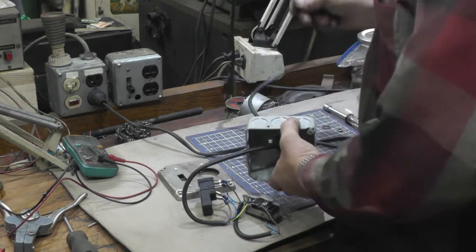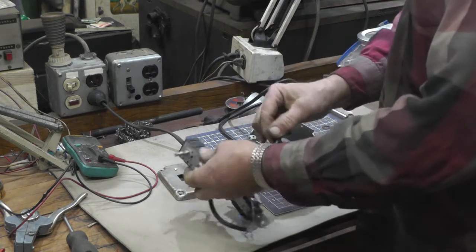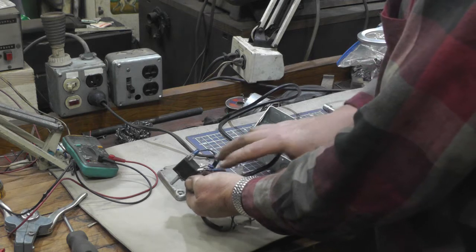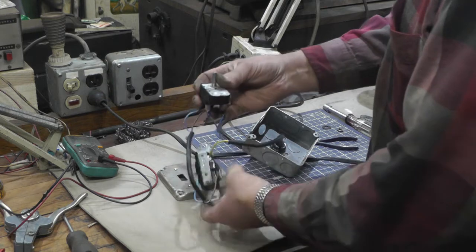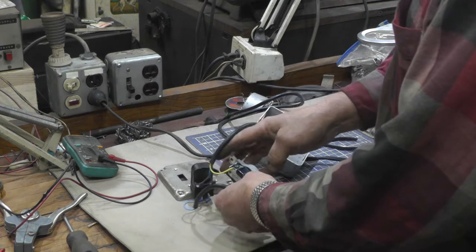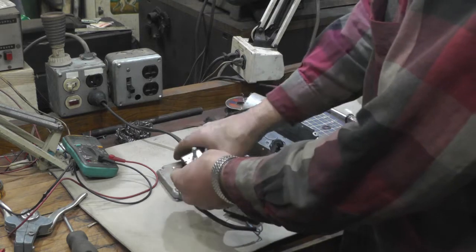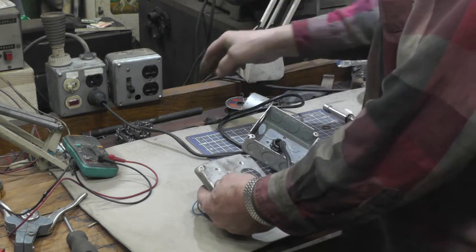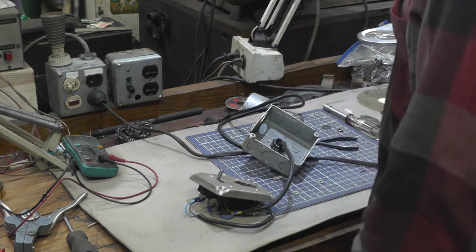The timer one is coming along. I've got the cord run through the back, same as the other one. The cord comes in and goes to a two pole switch as well, comes out of the switch and goes over to the outlet. The ground is hooked on to the outlet again because there's no provision on the timer for a ground. It's just a matter of mounting the switch and the outlet in the cover, mounting this on the bench, putting the cover on, and giving it a try.